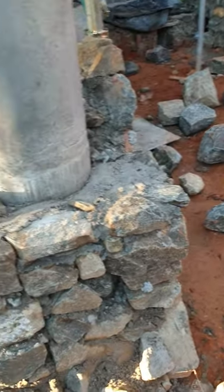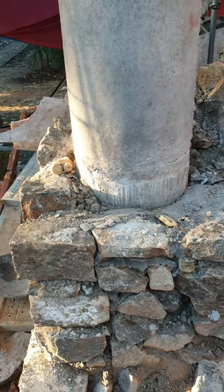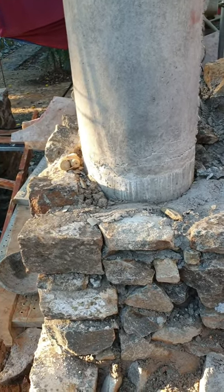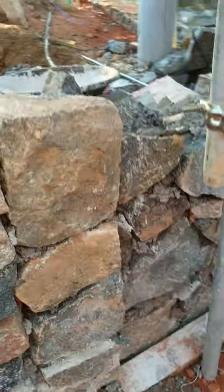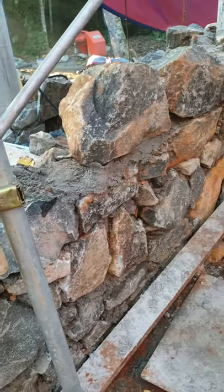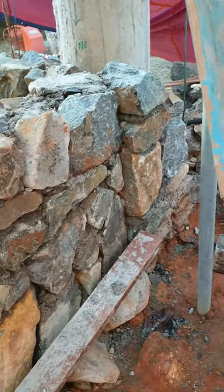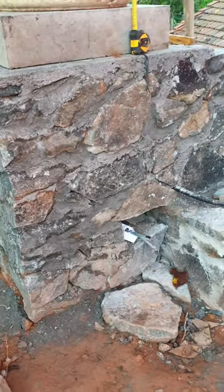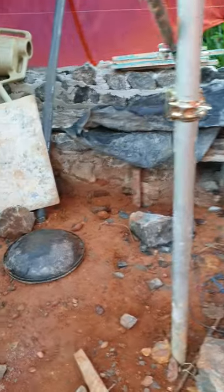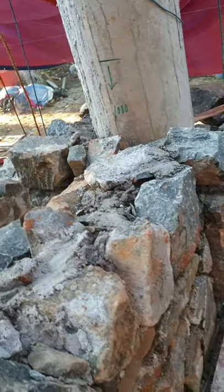And maybe in one place we may make it look like the lime mortar was damaged and then one of these stones will be visible, but, I repeat it, it's not a stone wall to be appreciated as a stone wall. It's just going to be a mortar covered wall. And that mortar covered wall could be anything underneath. It could also be cement blocks or whatever, but it turns out that we prefer to make it all in stone because it's much stronger, and also the stones are actually less expensive to buy than the cement blocks in this country, in our location.